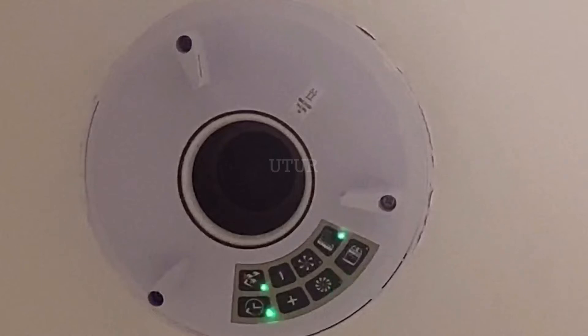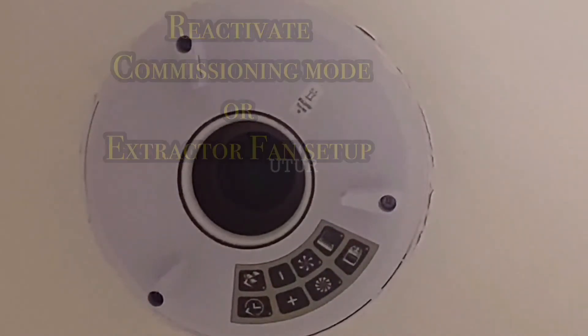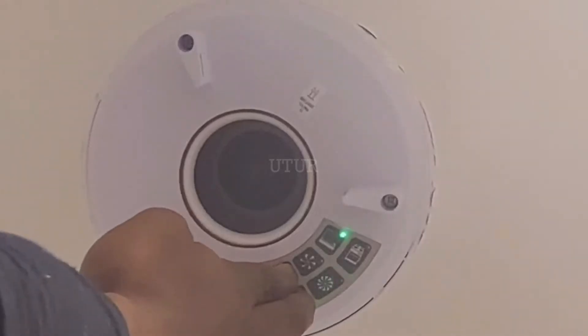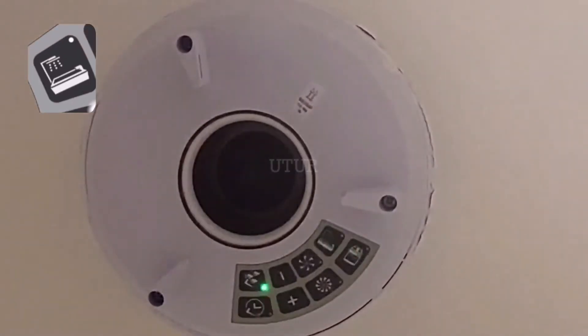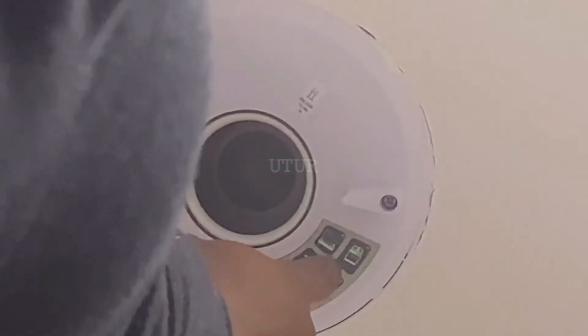For the bathroom, to reactivate the commissioning mode, press and hold the minus and plus buttons simultaneously for about three seconds until the bathroom and kitchen lights flash. We are in the bathroom, so select the bathroom as the appropriate installation location whilst both room selection lights are flashing.